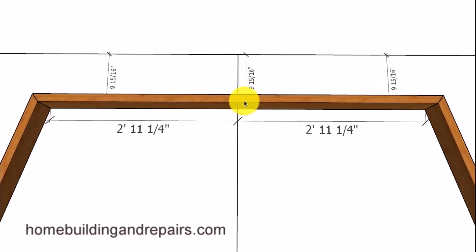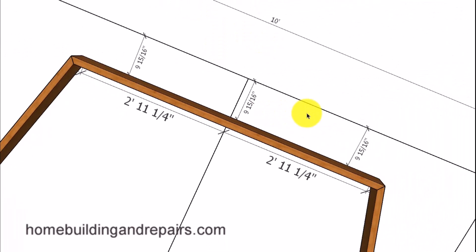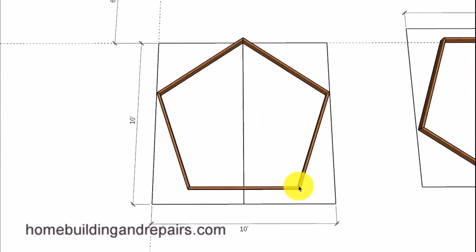However, we would need a parallel line — or a string or form on the outside creating some type of square shape — to measure off of and make sure this board is parallel to the line. Another thing you can do to double check a pentagon is to measure from one point to the other point and make sure all of these measurements are exactly the same. If they aren't, this might require you to pull it in a little bit or move it or adjust a couple of the other points until all of the measurements are the same.